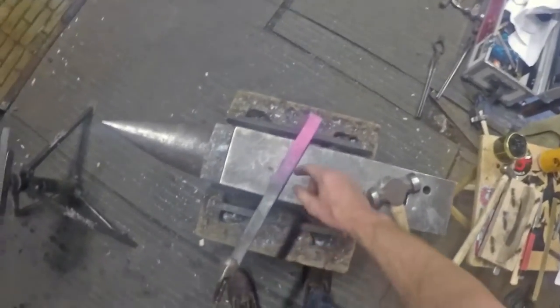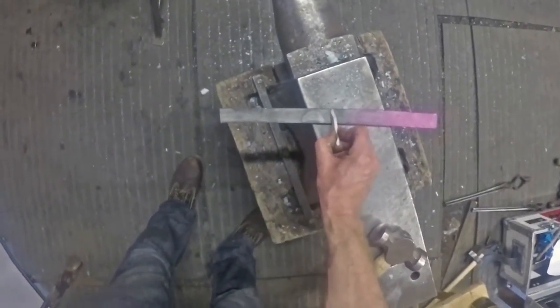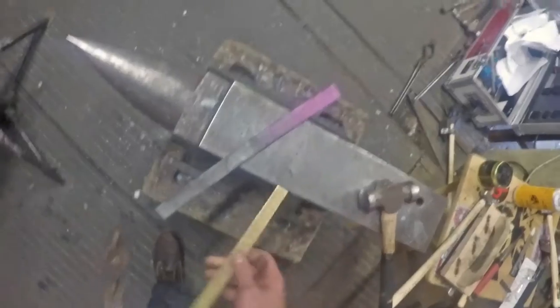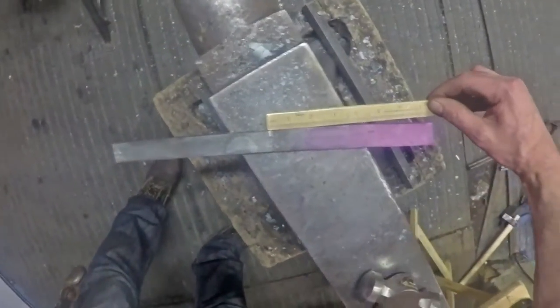That's obviously my outside branch. I'll bend my toe - I haven't got a centre mark on it but I know roughly my centre's about there. I bet if I measured it that'd be pretty much spot on. So I'm just going to bend that and that'll be my toe bend, then I'm going to hockey stick the outside and back it up. Seven and a quarter - oh, just off by an eighth of an inch. That'll be about right there.